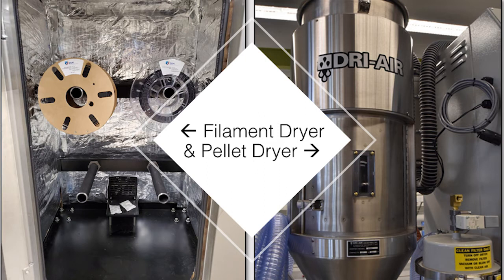The filament used in FFF is produced in either 1.75 or 2.85 strand diameter and it's wound onto a spool. These spools are stored and loaded into the 3D printer. For FGF, the pellets are contained and dried in an industrial drying hopper, typically located outside of the machine. Materials called upon from sensors within the machine are conveyed through corrugated tubing into a smaller secondary hopper. Within both types of additive manufacturing processes, consideration of proper material storage and pre-processing procedures can help ensure effective results.